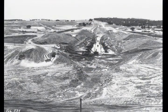Because removing and replacing large quantities of foundation materials is very expensive, the usual solution has been to leave natural soils in place under parts of the dam. Until the early 1970s, it was common practice to leave apparently competent soils in place under the dam. These alluvial soils, which contain large amounts of sands and gravels, were deposited by the river or stream that was being dammed.